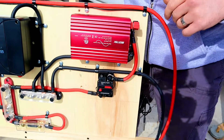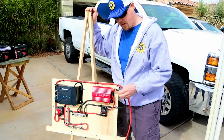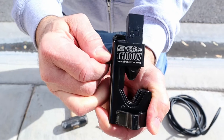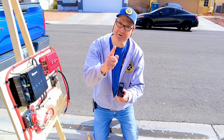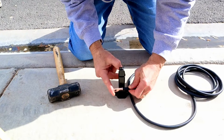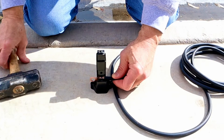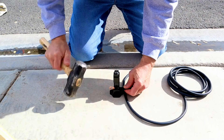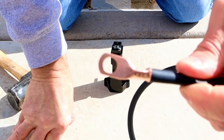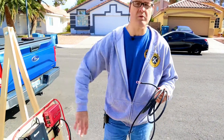For the charging side we ran the same four-gauge wire to an oversized circuit breaker, so when we upgrade our inverter in the future it'll already be sized appropriately. This 300-watt pure sine wave inverter will power sensitive electronics and hopefully a Starlink unit. To make the battery terminal ends, we use a hammer crimper from Amazon — put the shrink wrap on the wire, put the lug on the end, place the crimper on top, and two good whacks is really all you need.